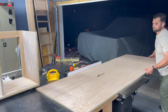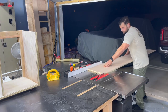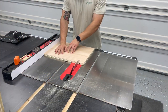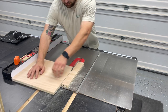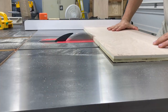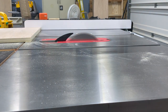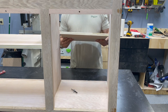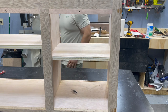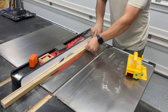Next I went over to the table saw and started cutting out the strips that are going to become my shelves — two passes just like before, an initial pass to remove the bulk and then a cleanup pass. Off camera I roughed everything down to relative size, then made my final pass on the table saw. I switched to a zero clearance insert plate for the table saw — if you've ever worked with veneer plywood it loves to tear out, especially when the cut is unsupported on the bottom side, so the zero clearance insert makes this a whole lot easier. As long as you did everything correctly, you should have a nice tight fit.